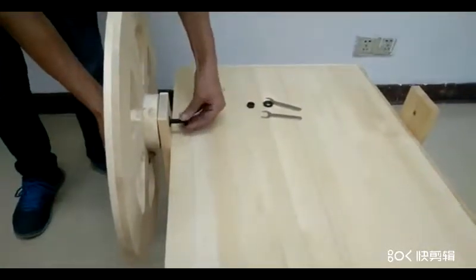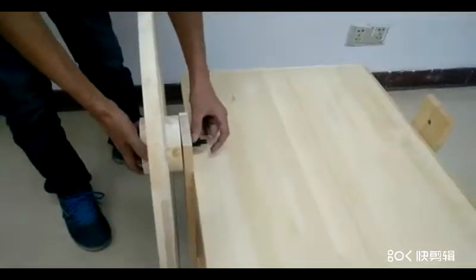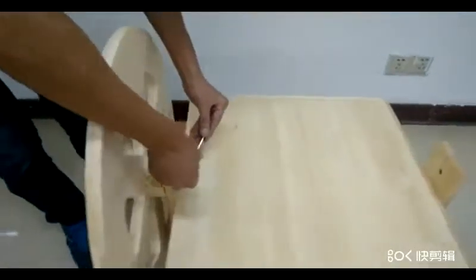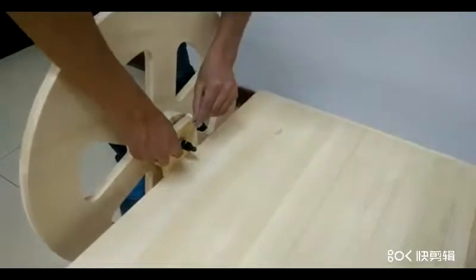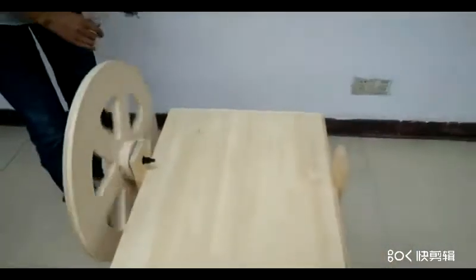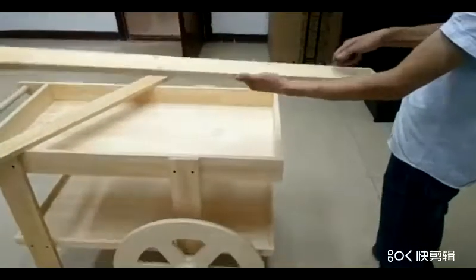You may ask, why two nuts? The two nuts lock into each other without locking against the support leg nor the wheel. And this allows you to set the boundaries for the wheel. You can do so tighter, you can do so looser, but bottom line is the nuts lock into each other to allow the wheels to spin freely.